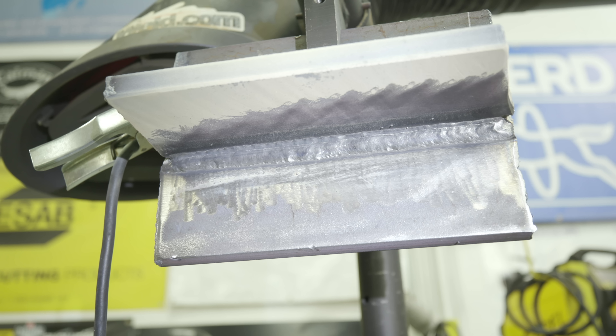Not bad — got the coverage I wanted. Still not too impressed with the bottom part of that toe; that's probably just technique and I need a little more practice with this. For pass number three I'm going to go on the top toe of my second weld, tie in and cover up all of pass number one, and tie up into the horizontal overhead plate.